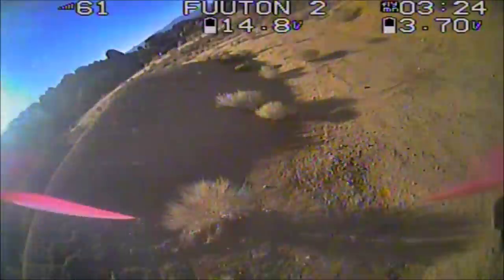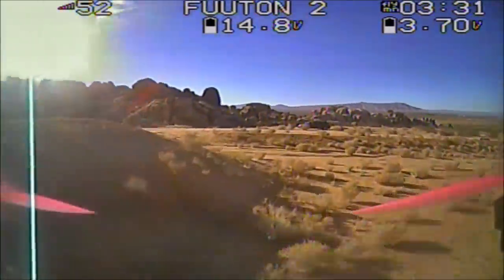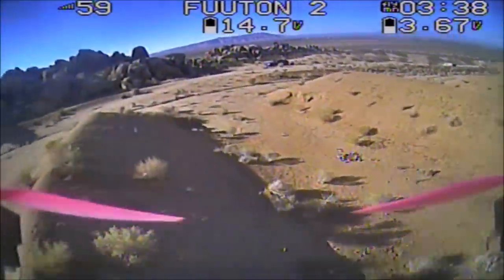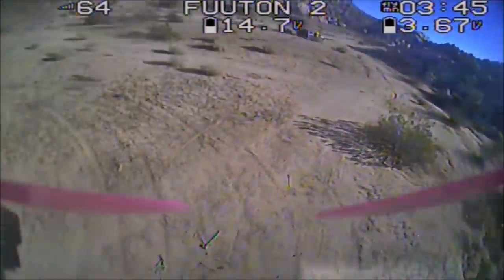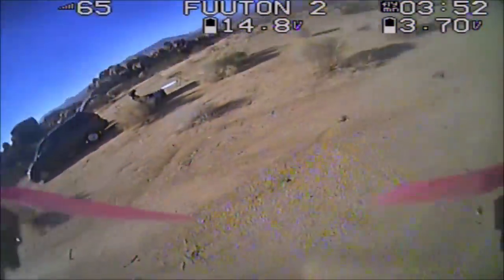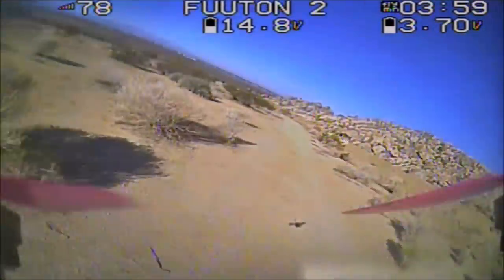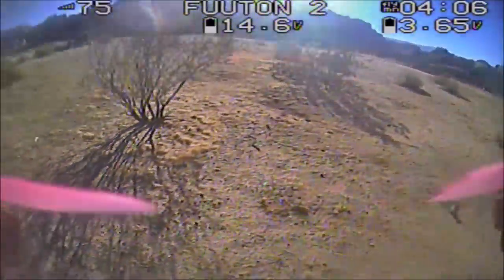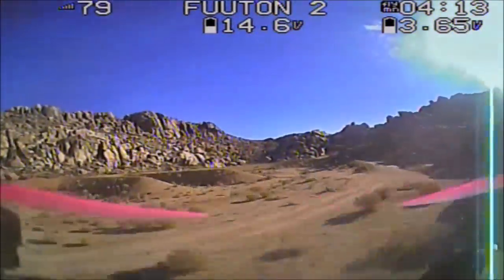If you want to get one of these Jumper remotes and you haven't gotten one already, this is another one to look at because it's got OpenTX. It's just like working with a Taranis, except slightly smaller. And this one is going to last because it's got the Hall Sensor Gimbals. The other version, I think it's a little bit cheaper, but that one still has the potentiometer type gimbals. But this one will last you a lot longer because of the Hall Sensor Gimbals.